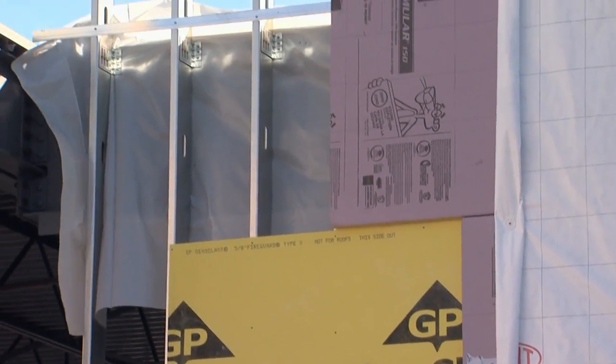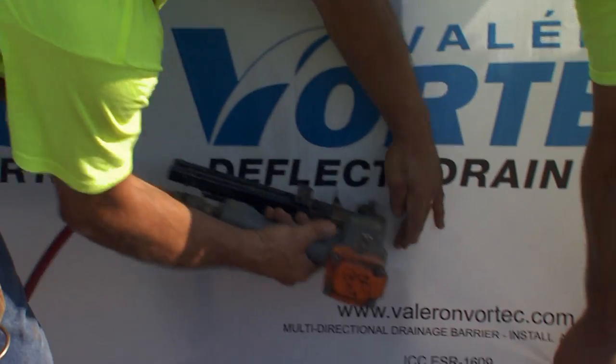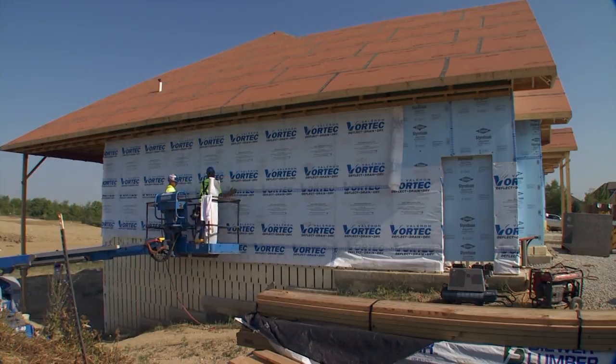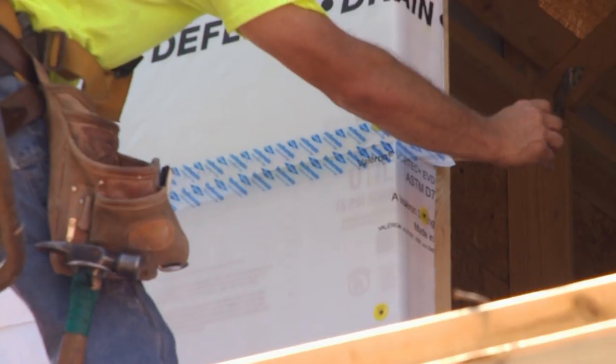You want to manage all of those and get them in the right order in your wall. The old rule of thumb when you had a masonry wall was to always leave the one-inch airspace to take care of airflow and water. But now we're talking about some different elements — more like drainage systems, drainage mats, and rain screens, where the construction of the wall creates a plane on the outside that 90–95% of the bulk water that hits that building is shed off. In masonry construction, that's the brick. And then behind that, we have a pressure-equalized air chamber, which creates a disconnection between the inner wall and the outer wall. If water does get through that outer plane, it either runs down the back of that plane down to a managed layer and back out — and you don't have continuity where that water can continue wicking through.